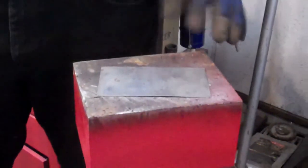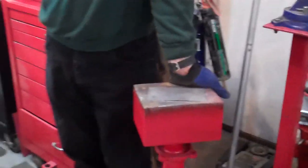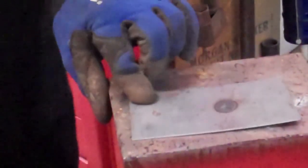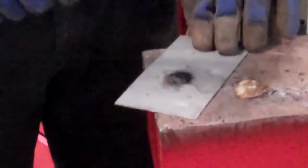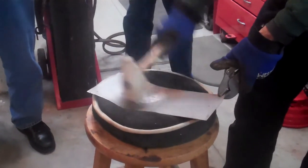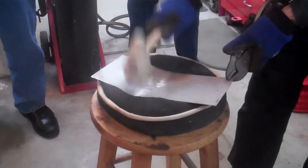I could continue to hammer that down, but then the metal around it is going to come up the other way — you're just going to make another dish on the other side. I've had some friends swear by a disc that you can put on your grinder — a shrinking disc. Yeah, heat shrinking on metal. So about a dime's worth and then get on it, and try to actually fold the metal toward the center — and you're back to flat.